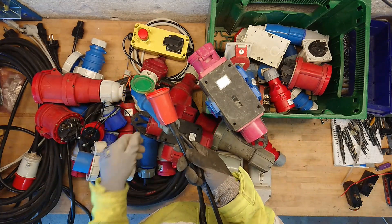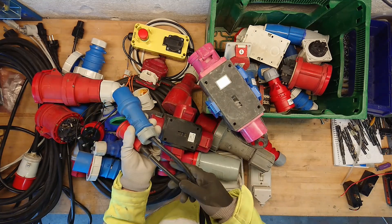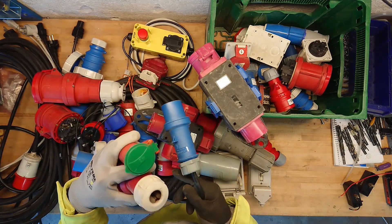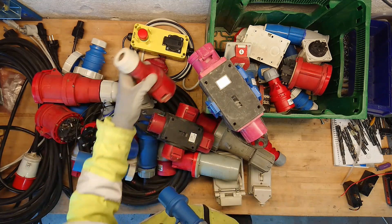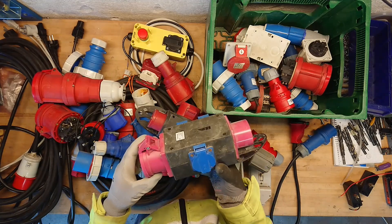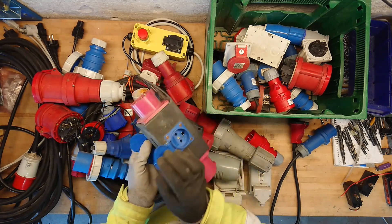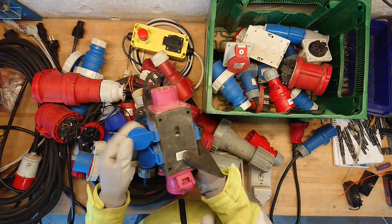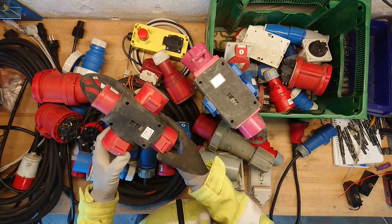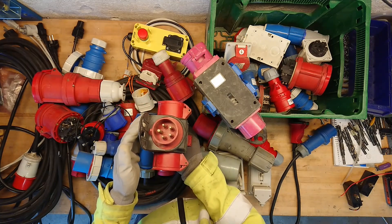Because they are only spec'd for having one cable going out of them. So once you see these illegal versions where you have three cables coming out of something like this — which goes into three 230 volt AC from the three times 400 volt — well, instead you can just use these extenders. Much better, and they only cost some 30 euro, so not exactly expensive for the convenience you get. So not having 230 volt AC spread out over the three phases, or just extending out to three new 16 amp services.